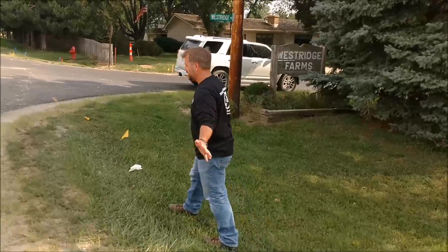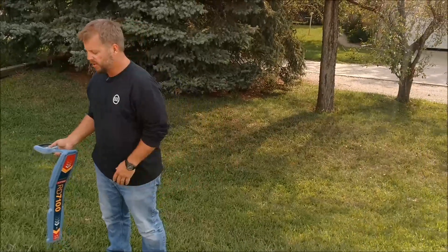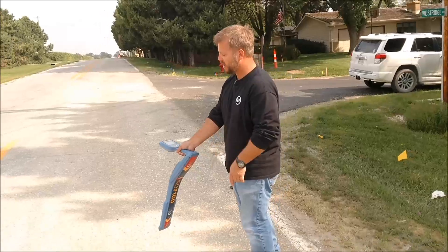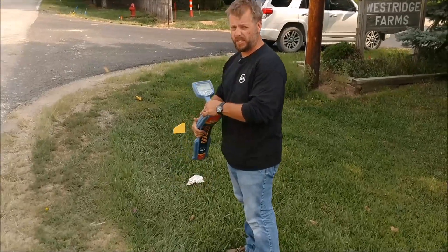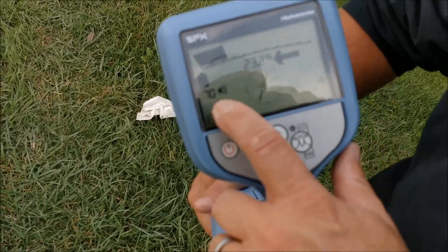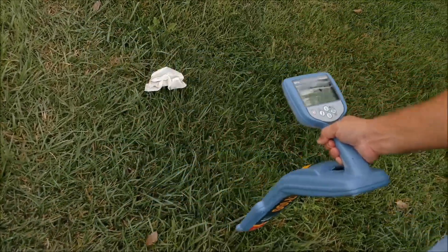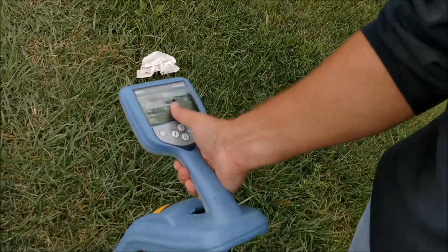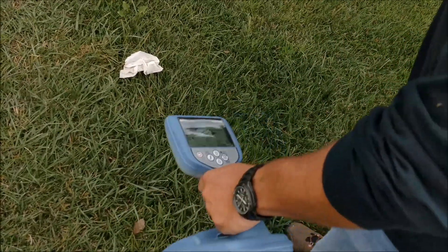If you don't know what direction this line goes, you would make yourself a nice circle with the back of this receiver always pointing to where you're hooked up. As you're walking that circle, you're going to see the numbers go up and down. When I start my locate, I always start with my gain level — my sensitivity level of the antennas is found on the left side. I start with that around 70%, which it is right now. 70% should be more than enough to pick up your locate.